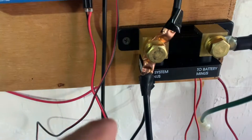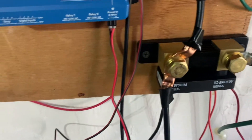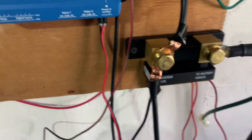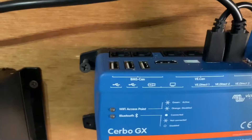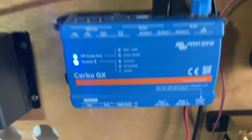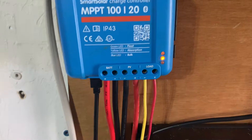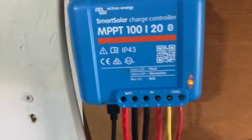So what have I got right now? I've got this 500 amp shunt that is connected to it. Forgive these connections — this is all being redone today. The inverter is on the way, this is all just temporary. Through these cables here, and also here's a Victron MPPT charge controller. It's in float already — it's 10 o'clock in the morning and that is communicating with it also.